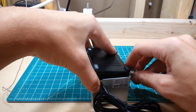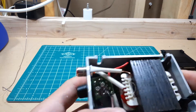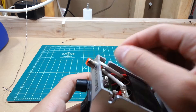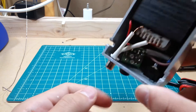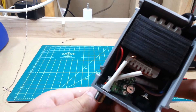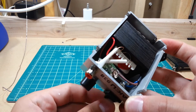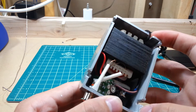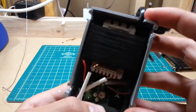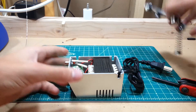Pop that open and you're greeted with the transformer — really big, solid transformer. So this is going to be turning your high-voltage mains into 12 volts, which is then fed to the iron. You've got a simple circuit board that I'm guessing contains your PWM switching circuitry for temperature regulation, a large potentiometer — really smooth, not gritty at all — and what looks like a calibration trimmer pot. You've also got a switch with a resistor going to it.